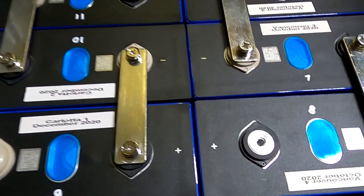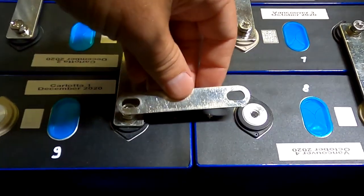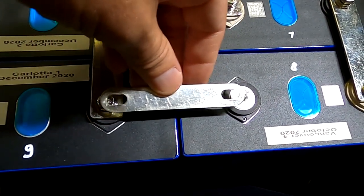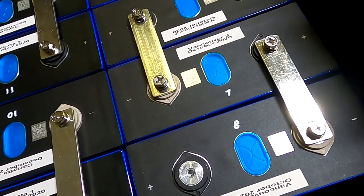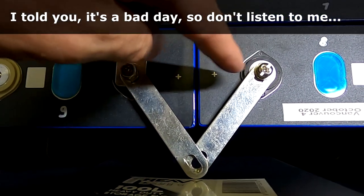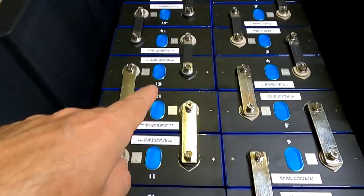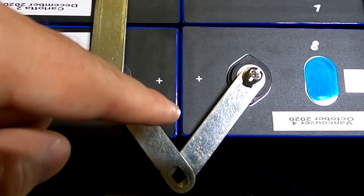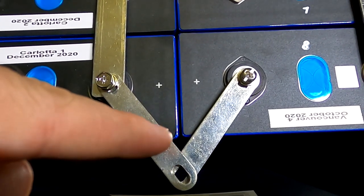So I just think again about my design here, because well, if the batteries need to be connected at the end here, one bus bar is not enough to cover these batteries in this direction here. But what you could potentially do is having two bus bars. So you could potentially do something like this. I mean, this is the wrong polarity now. I would need to change one of the rows here completely again, but this could be a solution to connect these two rows together here at the end. Then I don't need to crimp a cable. I'm really considering this one here.